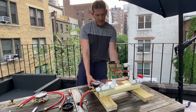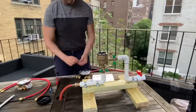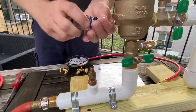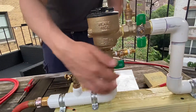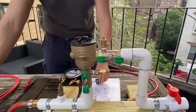Record the results and restore the system. Remove all of your equipment, replace the bleed screw, close the test cock, open shut off valve one, open shut off valve two, and then replace the canopy.